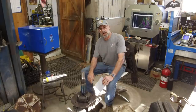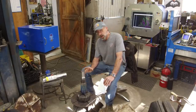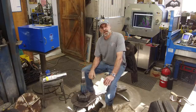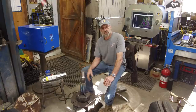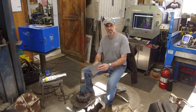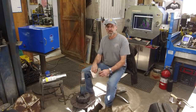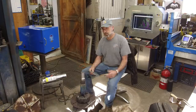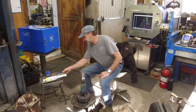We're going to cut a piece of shim and put it around the bearing diameter underneath there so the jaws don't come in and make an imprint or a blemish or any kind of scratch on that surface. Because when you start heating things up, they swell and contract. Even though you might not have it tight, when it heats up it swells and creates pressure, and the aluminum absorbs some of that pressure.